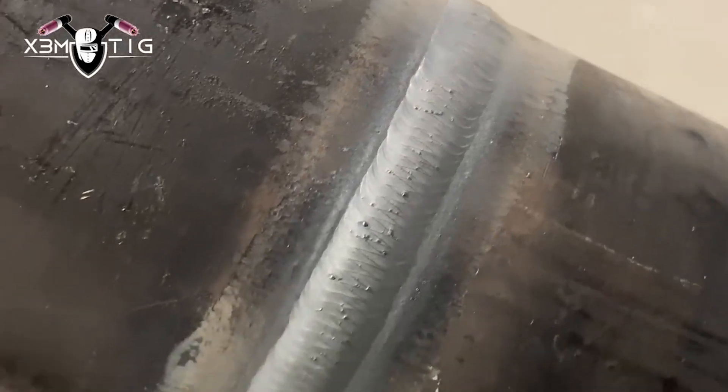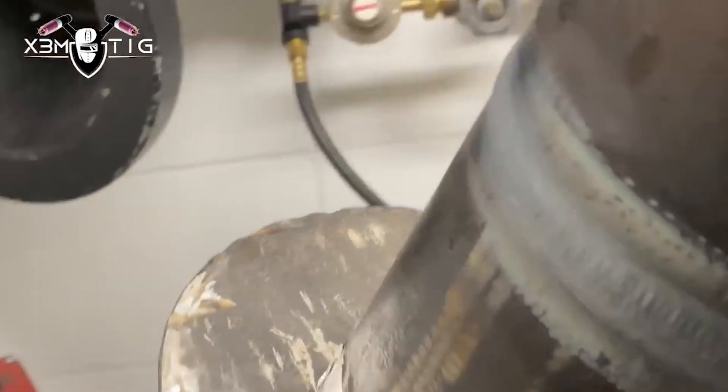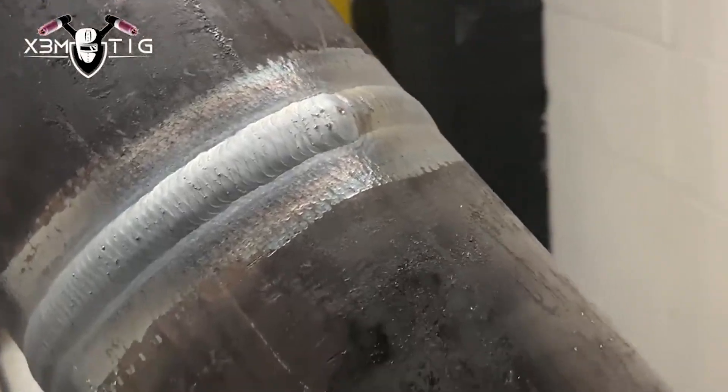Every weld is a signature. With experienced welders, as soon as you see the weld you know who welded that pipe. That's how the weld should look — nice and uniform, clean. Always after each pass, clean it so you don't have any impurities contracted from the pipe — dirt, oil, grease, whatever. Thanks for your support, hope you liked it and learned something new. Remember: you've got to burn to learn, there's no other way around it. Take care, see you in the next one — play it safe.